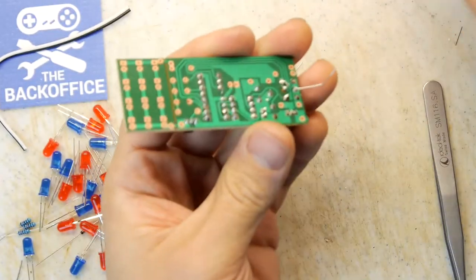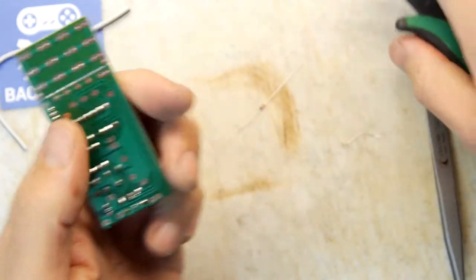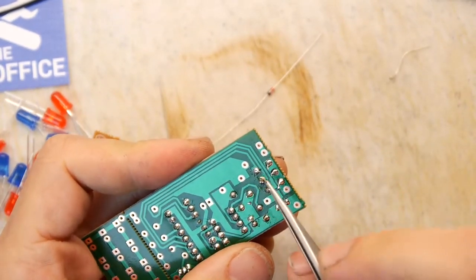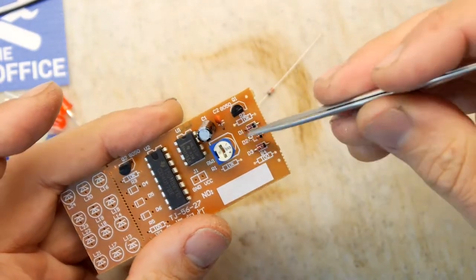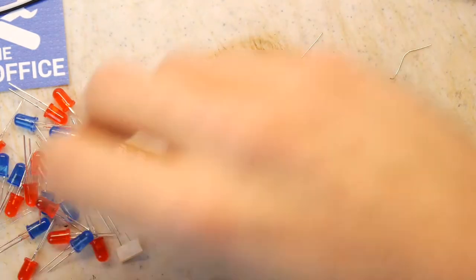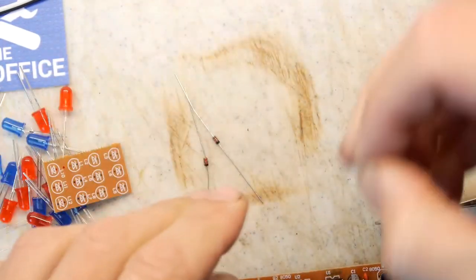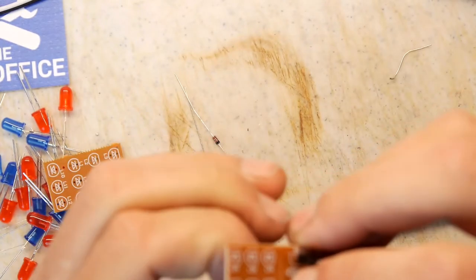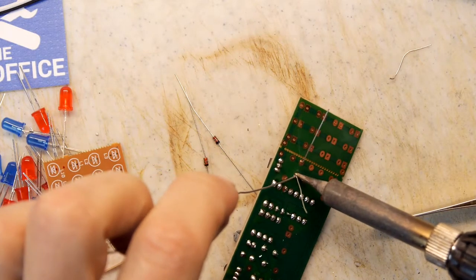Oh my, that's it. I've broken the PCB, being very rough. I've got these side cutters here, and I've been very rude with them, I'm afraid, and I have damaged the PCB. So this is a good chance to show you how you could damage a PCB. And yeah, I've really damaged the diode too, because not only is the PCB damaged, the actual diode is broken. Let's ignore that. Keep going. I don't think I'm going to forget about fixing that. So my advice is, if you're doing these diodes on your board, probably just solder them one at a time, because they seem to be a bit fragile, and that whole big mess of wires lends itself to something getting smashed up.